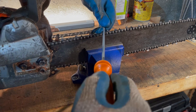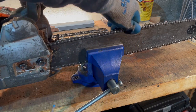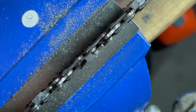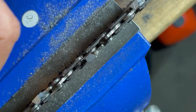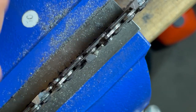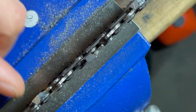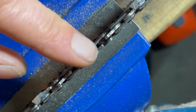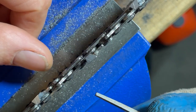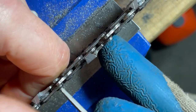Now you can see as I go to try and sharpen that, the chain doesn't move too much — but it's still not too tight. A lot of people try to feel how sharp it is, but feeling is the worst thing you can do because most chains always feel sharp. If they've lost the edge, they're still going to feel a little sharp — but that doesn't mean it's sharp. The best way to see if it's blunt is by visual inspection.